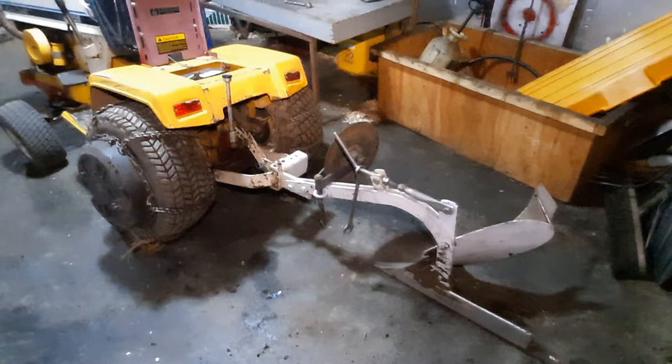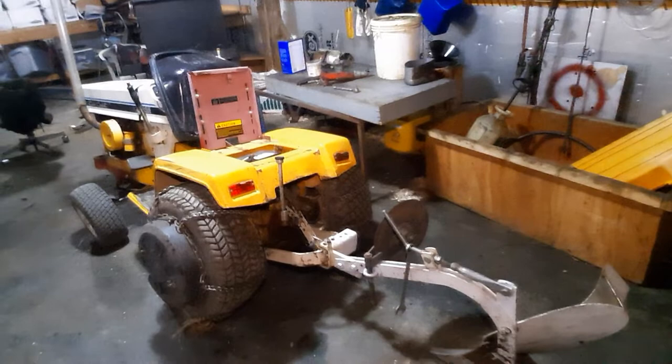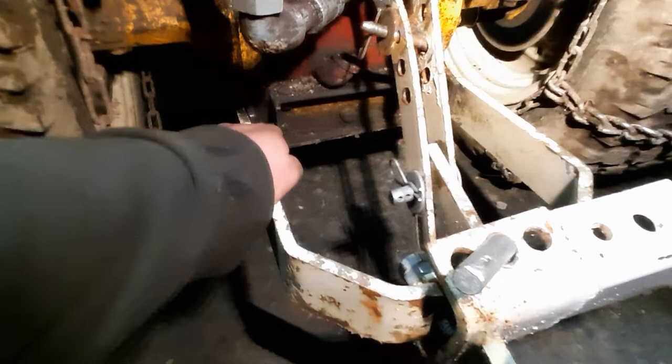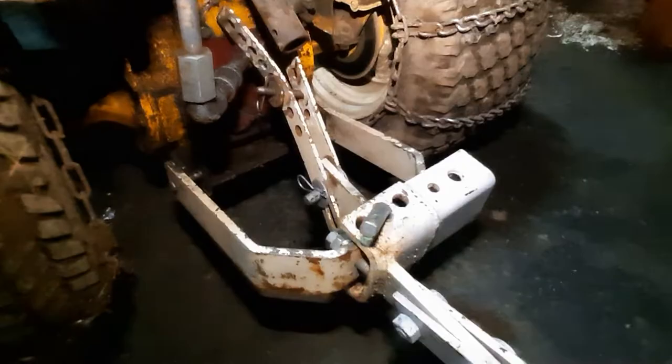One more mod: the hoop was a little wide so I added an inside plate so the pin can't cock itself - no play in the hoop, which gets maximum lift out of these things. Cub Cadet could have done something better by pulling with a drawbar instead of pushing with a push rod - you could feasibly do it with one-by-one square tube that wouldn't bend. Thanks for watching, I hope you find this informative and helpful. Come join the channel and we'll see you in the next video.